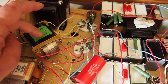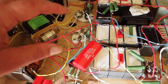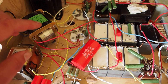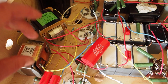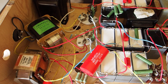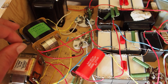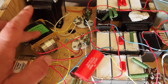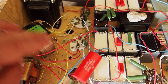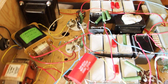Having it as an interstage or earlier — where the signals are smaller, and because I'm also working with open secondaries — every stage drives the other stage with open secondaries, there's no grid resistor. Secondaries are open, which means there's a very high load placed on the preceding tube, making the load line really flat. I think that suits these types of cores a lot better. I still want to experiment with a permalloy core as well. The amorphous core works really well in that position with open secondaries where there's not much current, but there is really the accuracy, the voltage swing, and the detail — while the iron core provides a lot more weight. So that's feature number one.